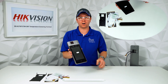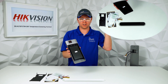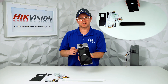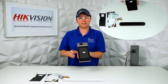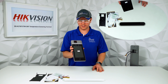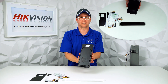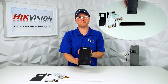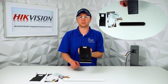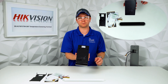We'll be doing a follow-up video on how it works — distance, mask detection, hot coffee on top of your head, etc. So keep an eye out for that. This has a seven inch LCD screen and a two megapixel camera right here. It supports Wiegand and RS-485 for wiring, which I can show on the back. The version of Hikvision Central Pro you need is 1.6.0016, and IVMS 4200 you need at least version 3.2.50 for it to be running.